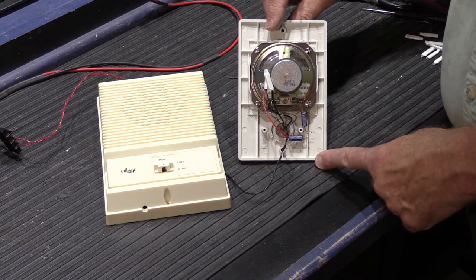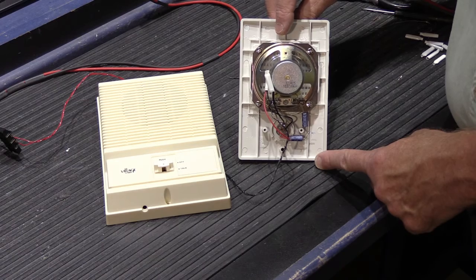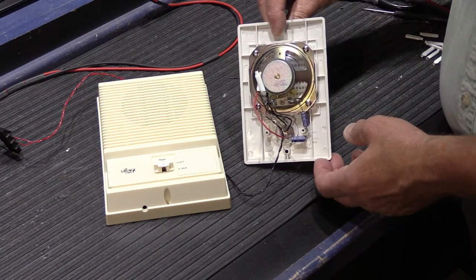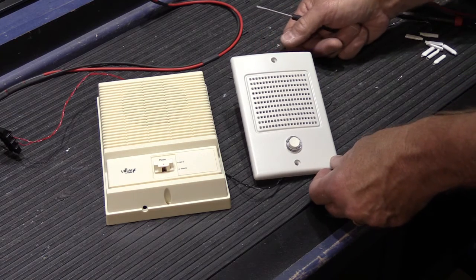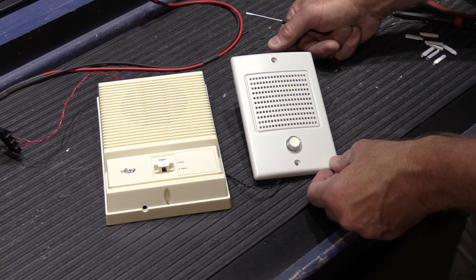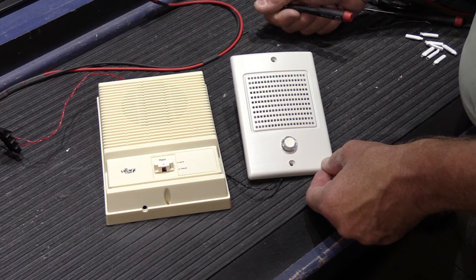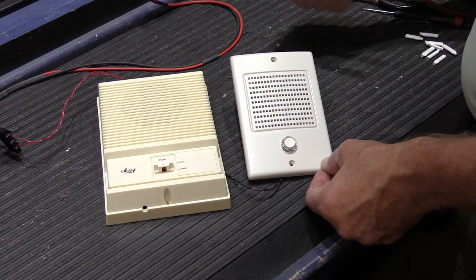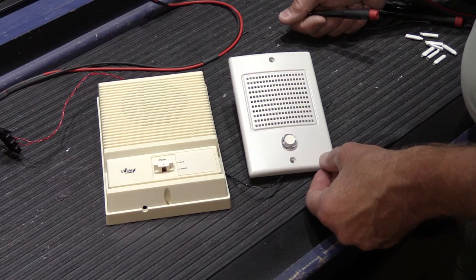So if you have a failed IS68 on your IK15 or IK25 door station, I'll put a link to the other video about how to do the conversion in the description. Please don't go to eBay and spend $145 for new old stock IS68 — that's just crazy money. You can buy a speaker like this for around $45, a couple dollars worth of capacitors, and 20 minutes of your time, and you've got something much nicer than an IS68 ever was.